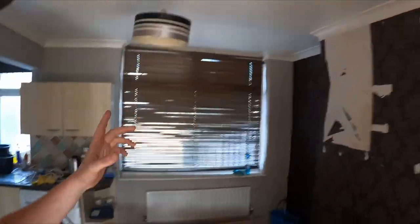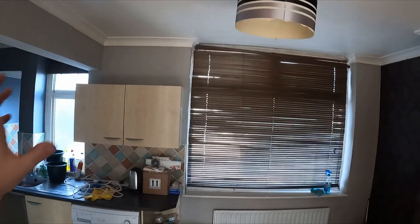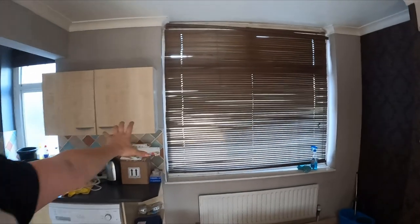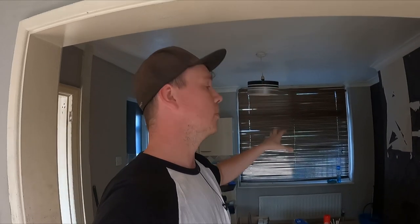Outside, I'm going to run a 16mm twin cable through the floorboards - either hiding it in the floor or leaving it in the ceiling. The house is also getting a big extension out the back, a conservatory slash orangery slash dining room. We want to make sure we're bringing cables where we can bring a socket cable feed and a light cable feed, and speak to the customer about what they prefer.